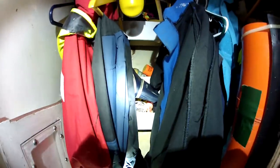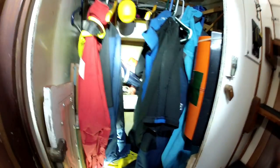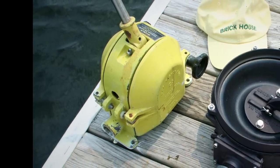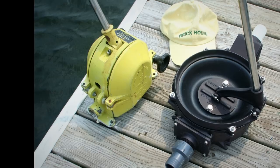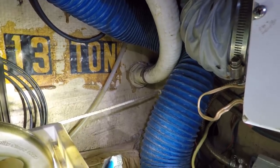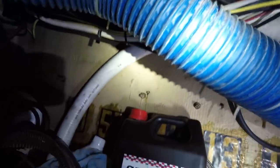Normally we try to dry the gear before it goes into this locker, but even if it did go in here wet, any water would just drip down into the bilge. There's a nice big shelf up here, another shelf a little further down, plenty of storage space. This is also where we keep all of our flares and emergency signaling equipment, and where the emergency hand-operated bilge pump is located. What was in this space originally was a Whale Gusher 25 — it wasn't installed properly. The discharge went directly out over the side without a high loop, so it's very easy for seawater or rainwater to back right down that discharge hose and settle inside the pump. The proper discharge loop starts at the discharge through-hull and goes up just as high as possible before it goes back down to the pump.